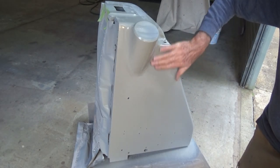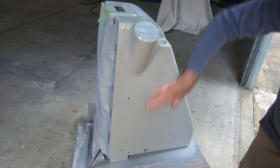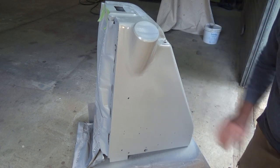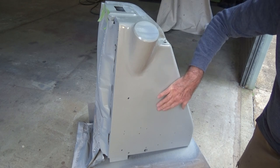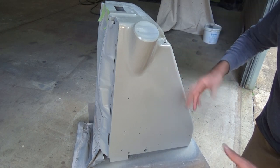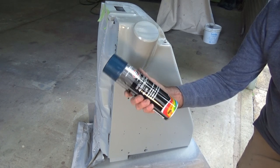This is the knee casting now after two coats of that sealer surfacer. It's got a slightly shiny feel to it now, and this is ready for a final rub down before we put our top coat on here. So I'm going to do a guide coat on this, and then I'll hit it with one of those sponges, get the surface smooth. I'll do any minor spot filling that needs to be done on this, and it's ready for final coats, I hope.